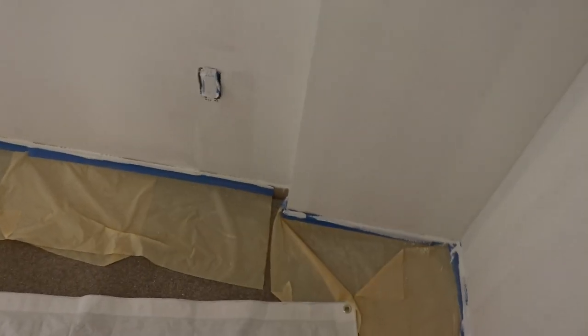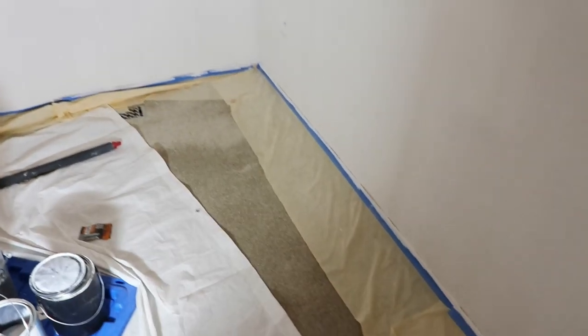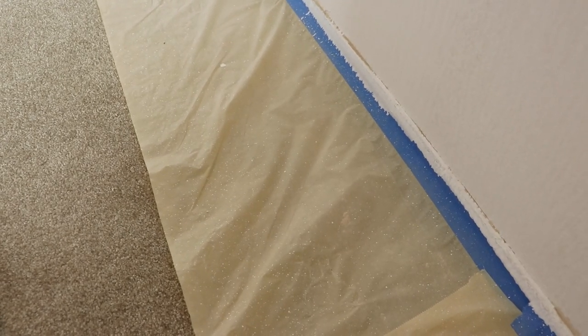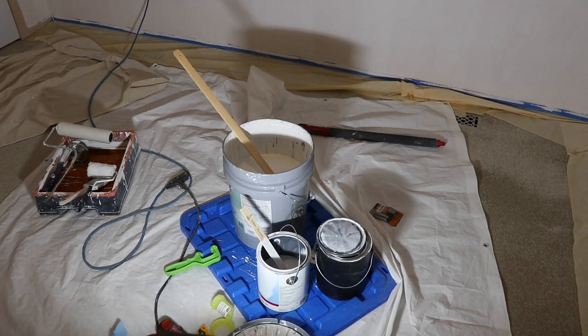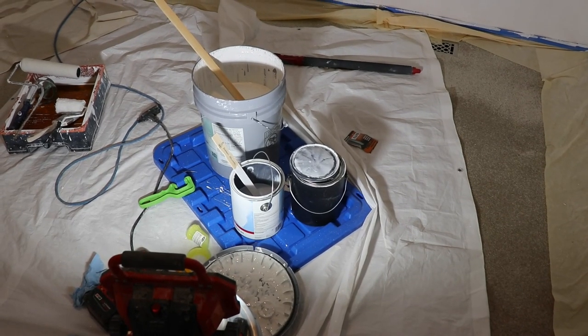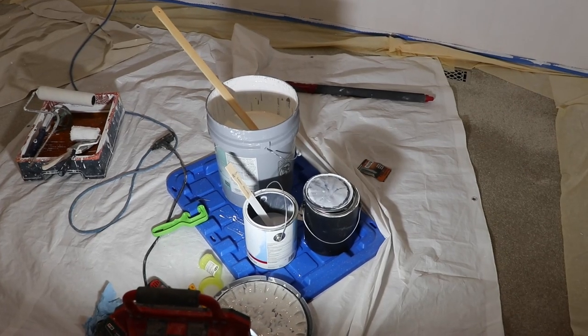In this room I didn't do a very good job on the trim because I'm ripping it out after priming — I just wanted to protect the carpet. There's a lot of spatter; normally when I paint it's not like that, but with the Sherwin-Williams paint was flying all over the place. You'd need two coats of that to get the same result as one coat of Benjamin Moore, so there's less cost savings and more work. I'm not a fan.